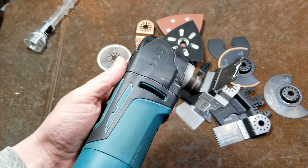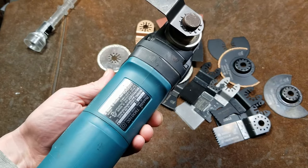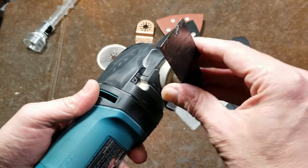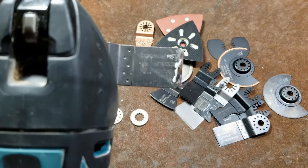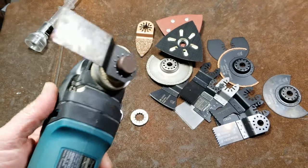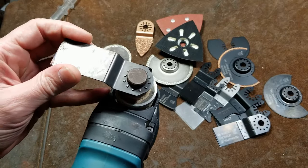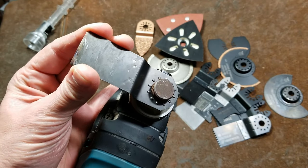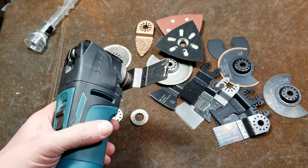In my experience, I've had lots of Bosch's, DeWalt's, Porter Cables — a variety of these tools. They've all been really terrible until I came across this Makita TM3010C. Really recommend it. Very stiff, very rigid, overbuilt mechanism, which needs to happen on one of these tools because how they work is they just vibrate back and forth. A lot of the brands just don't overbuild it enough, so the spindle is not rigid enough. The whole drive mechanism needs to be really rigid in order to actually deliver the energy to the blade, and when that happens, these tools work very well.